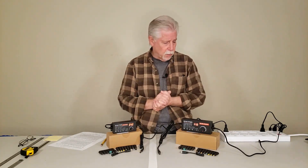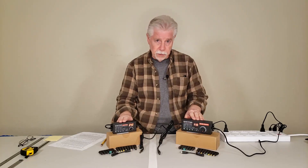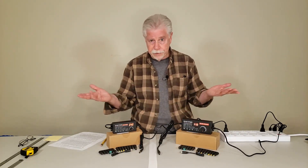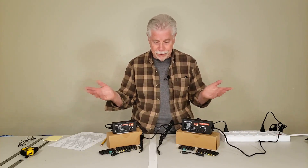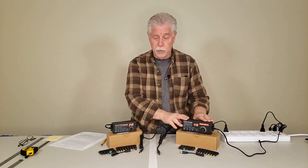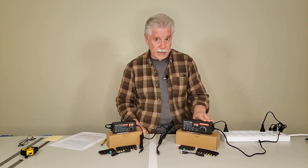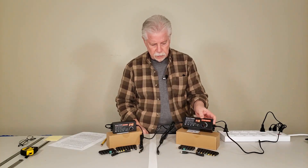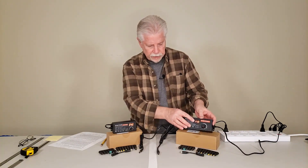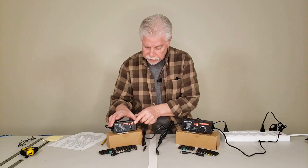These are really nice features. I looked on Amazon and couldn't find anything exactly like this. So you've got $20 for a 0 to 24 volt supply with 48 watts to work with — power equals voltage times current. Over here you have a 12 volt supply at 120 watts, which means right around 10 amps at 12 volts without a safety margin — that's a lot. It's a small supply but a nice thing to have at the test bench. I noticed the gauge here is showing 11.9 on the 12 volt unit with the dial turned all the way up, and over here it's reading 24.2 all the way up.